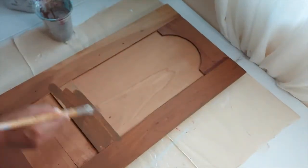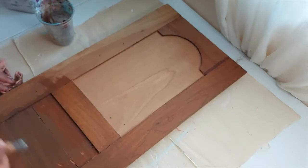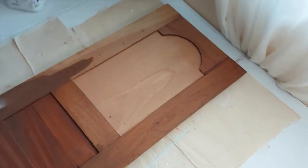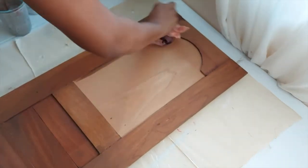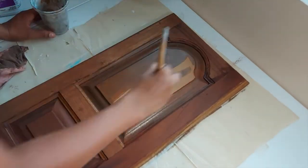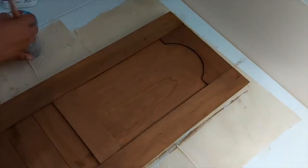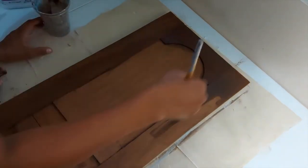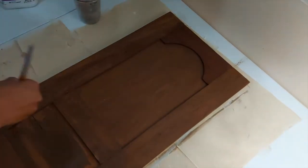To make this look like a stain I'm going to brush it on and then lightly rub it with my cloth in order to get it into the grains of the wood, so it will look more like a stain rather than paint. When the door dried I found it was still a bit light, so I mixed more paint adding more black, and this came out to more of the dark chocolate brown that I was going for.